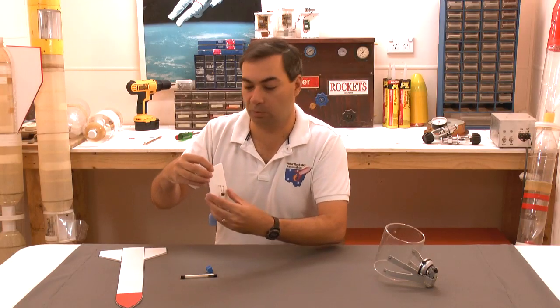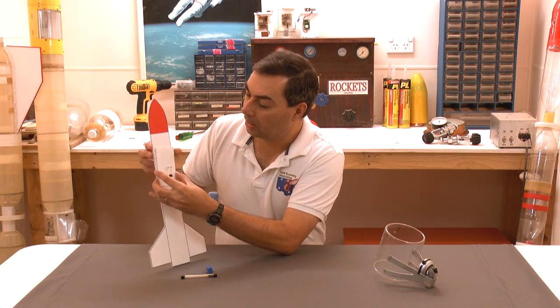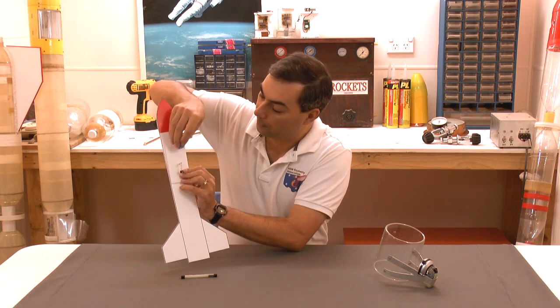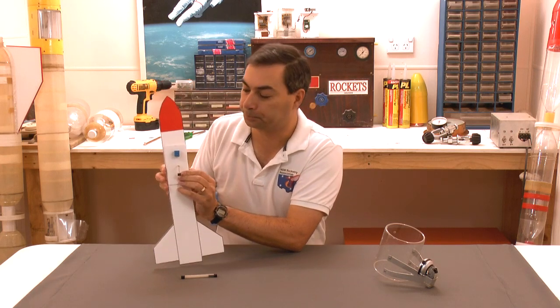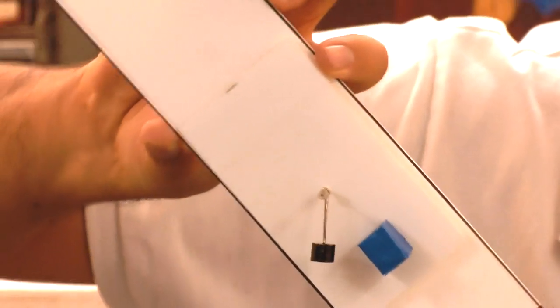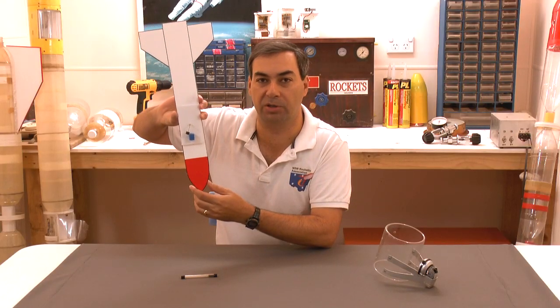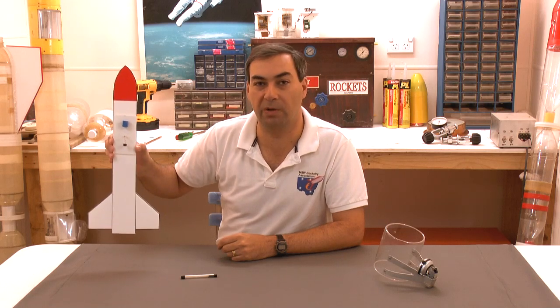And normally the way this would get used on a rocket is you would mount it this way and then put a trigger mechanism that would actually deploy the parachute above the weight. Then as the rocket takes off, it flies, and as the weight swings around and touches the trigger, it deploys the parachute. So that looks pretty good in theory and looks like it's working on the ground, but that's not actually what happens.